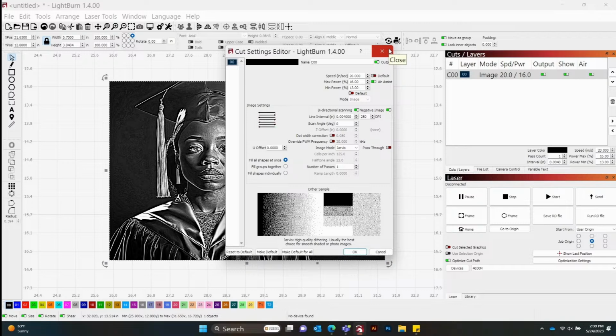It might also be your comfort level. You might want to run at a slower speed of 15, which means you might have to lower your power to 13. And if you're using a 2616 or a 2816, a 2816 would be very similar to the 100 watt machines, as most of those are 90 watt. The 2616 should be slightly higher in power, but you just play with it a little to find those settings you need. Sorry to interrupt you.